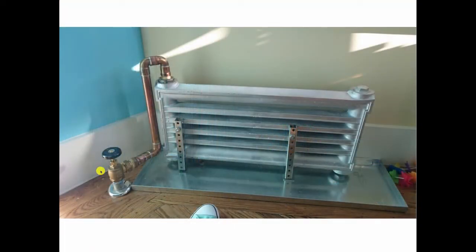This is a one-pipe steam radiator. We've got the inlet at the top, there's a vent down underneath, and we expect condensate to climb back out of the radiator and down the pipe. Looks good though, doesn't it? And he put a drip pan in there to collect the condensate. And there is the shoe of the person who did this — way to go.